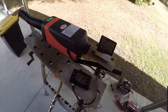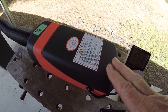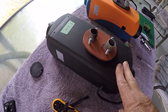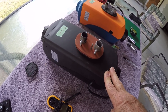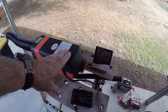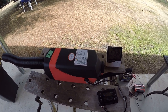If you have a power concern, consider this: running flat out the two kilowatt heater pulls about 2.8 to 3 amps, and so does the five kilowatt. But to produce the same heat output, the five kilowatt could be running at half speed pulling only about 1.5 amps, while the two kilowatt pulls 3 amps. My personal opinion is that it's better to get a bigger heater and run it slower than to run a smaller heater faster. I hope that gives you some understanding of the two kilowatt heater and the difference between it and the five kilowatt. Thank you for watching.